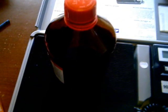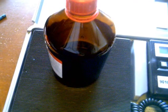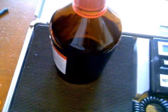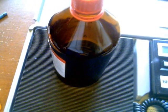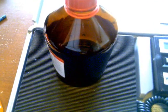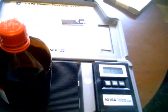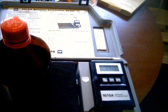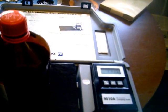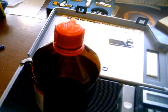I'm going to add about 0.04 pounds. The idea is to put a little bit into the funnel, then measure the bottle again and see how much has gone in. The next step is to prepare the charge valve for connecting the funnel and putting the methyl formate in.